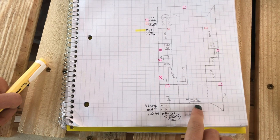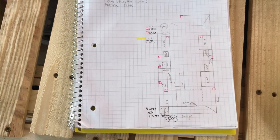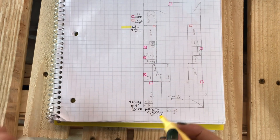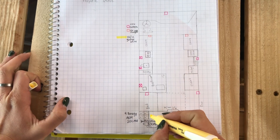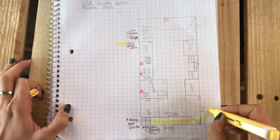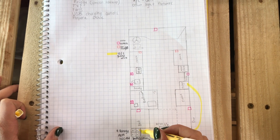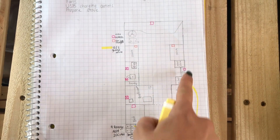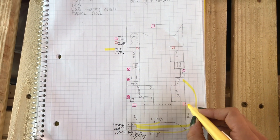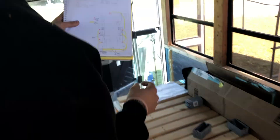All along the back wall of our garage area we'll have our circuit breaker — this is where all of our wires will run in through the sides of the bus. On one 12/2 gauge wire we are going to be running a 20 amp circuit from the batteries to our refrigerator. We'll also be running another 12/2 gauge wire from the batteries to our air conditioning unit in the bedroom, and then one running from here to all the outlets on this side — so they're all on one circuit.